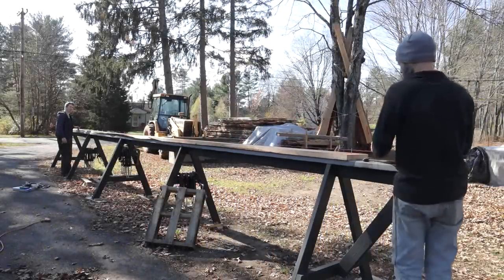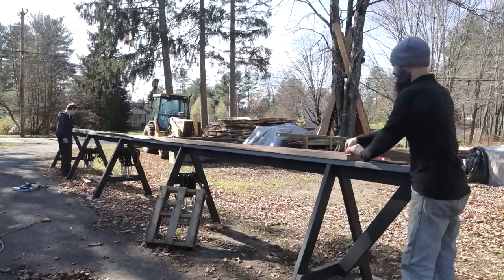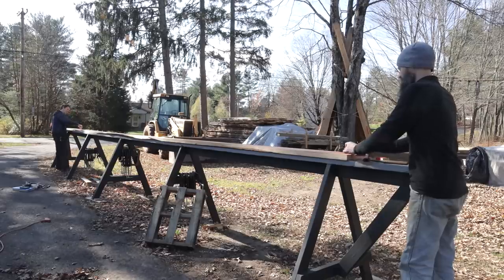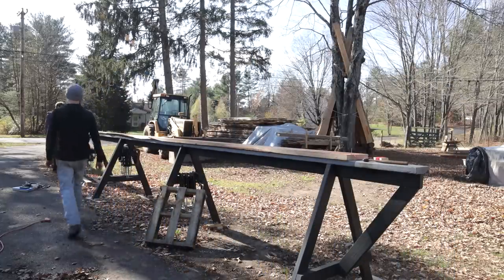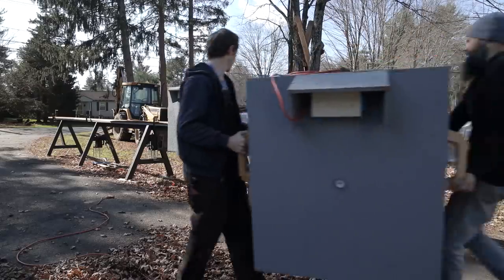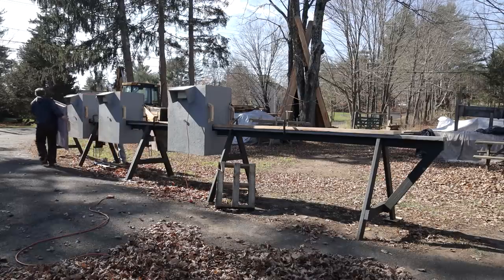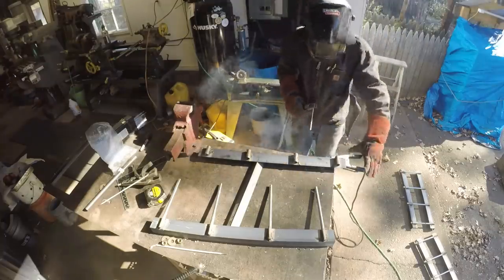The plank we prepared yesterday was ready to get glued up, so we laid that out on the bench — this end has sapwood we need to avoid, and this one has sapwood on the other side which we'll miss if positioned correctly. Using our warming boxes to heat up the joints and clamps first has been a great habit to get into and seems to be working great. It just adds an extra hour or so to the process. So while we wait, we'll tell you about what Steve was welding in the garage the day before.